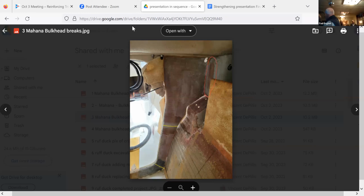And as Jeff pointed out, that's inherent in the nature of cutting that away to allow access. The base strength? Yes, absolutely. This carries the whole weight of the mast, the beams coming in, the daggerboard, it's the whole show. When you look at the tributary area on that front beam, it's at least 2/3. So it's quite a bit of load.